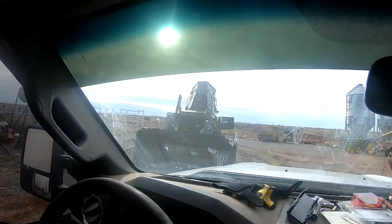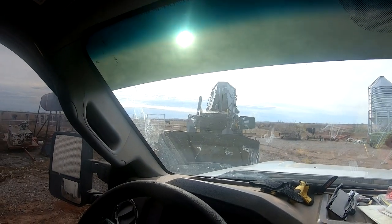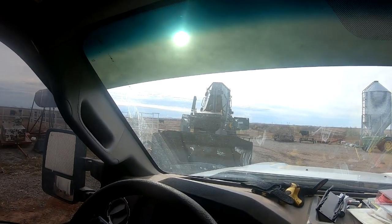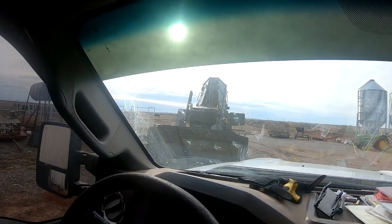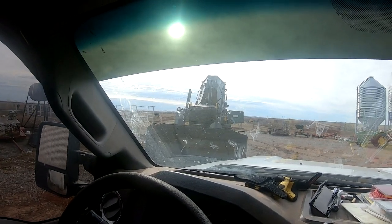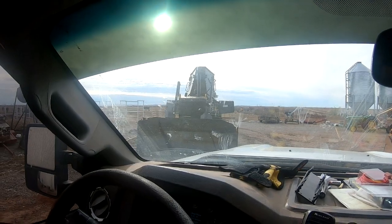Morning, everyone. Today, we're gonna attempt to run the power wire from the power converter on that dozer up into the cab and see what we can get done with that. Hook the air conditioner lines up. Once we get everything kind of in place where we can lower the cab back down, I'll have to pull a vacuum on that system and make sure there's no leaks, and just hope that everything is all right before I charge it. But pretty disappointed in some of the stuff.